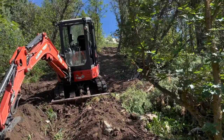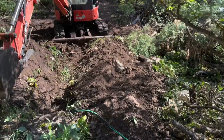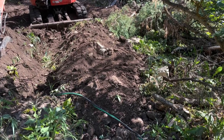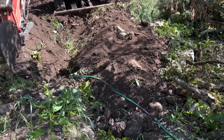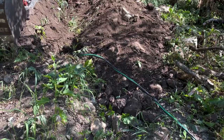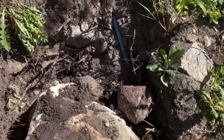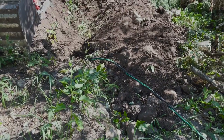We're here so far — that's the top you can see there. I dug out over here to the side to help bury this up. This is where we started hitting rocks and it was hard to get the water line very deep. Rather than trying to dig through the rocks next to the line and risk damaging it with the bucket or spinning a rock, you can see here's one of the spots that's exposed.